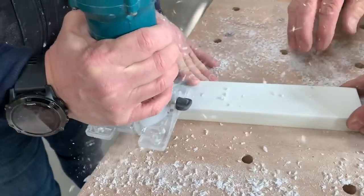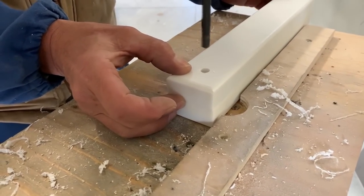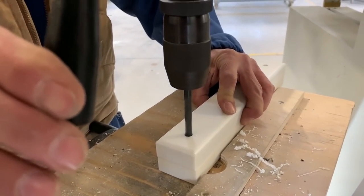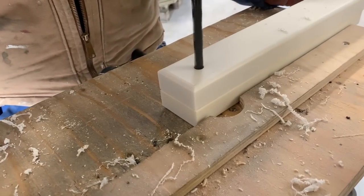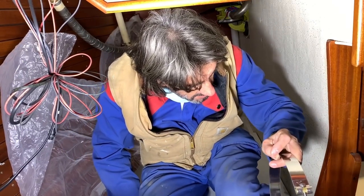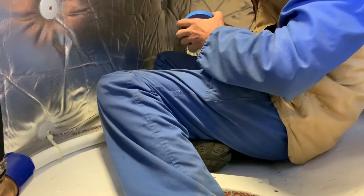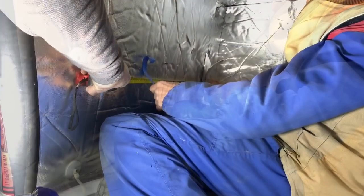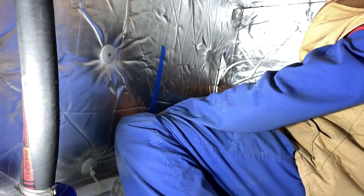After cutting the Corian, Franco marks around the contour and Andrea, in a while, will drill the holes in the correct position. The Corian is about 22 mm thick. We cannot use the old water heater's holes, so we have to find and understand where the new ones will fall to prevent them from causing disasters. We double check, triple check the exact position of the holes.